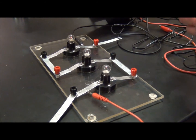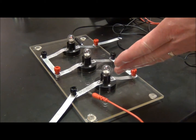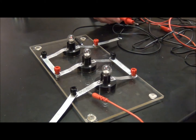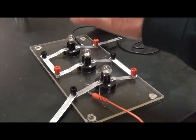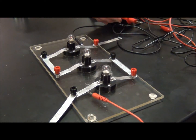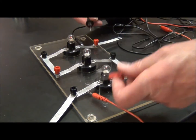For a series circuit, the voltage is divided among the electrical resistors, or bulbs, in the circuit. The sum of the individual voltage drops will give you the total voltage drop for the entire circuit. Said another way, V equals V1 plus V2 plus V3. Add the answers together from the data table and you will get the voltage total to compare against the reading gained by doing this measurement directly.